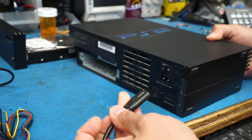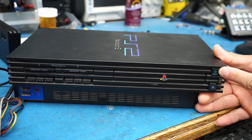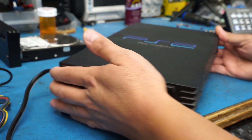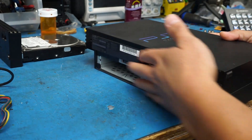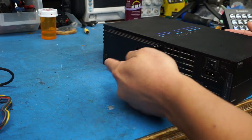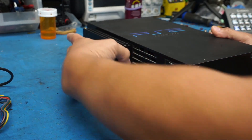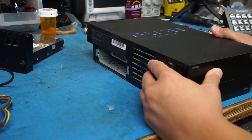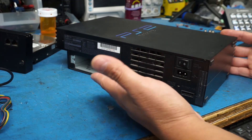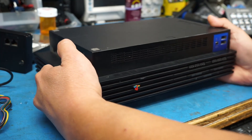What it's doing is just not powering up. If I plug it in and flip the switch, the standby LED is supposed to turn red, but it's not turning red at all — it's not getting any power. Before it completely died, I had a network and hard drive adapter inserted in the back, and if that was installed when you tried to turn it on, it would just shut itself off and you couldn't turn it back on until you removed power completely. Without it, it worked fine. So I'm thinking this might be a power supply issue — possibly capacitors.